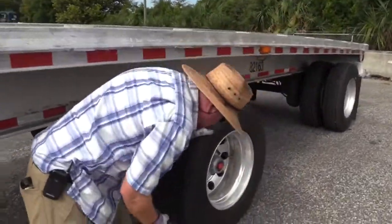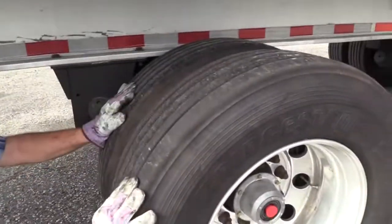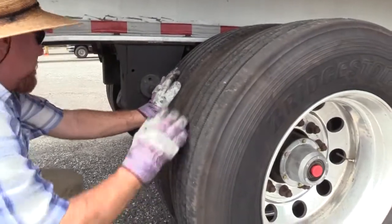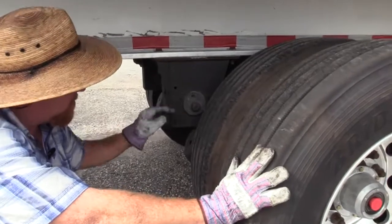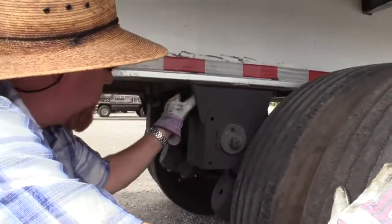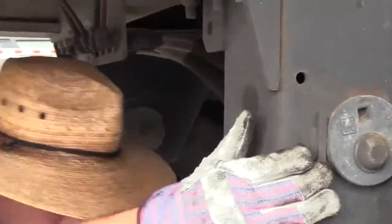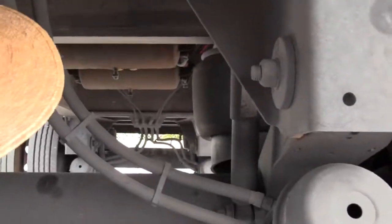Okay. We'll grab this axle right here, do our trailer axle. All right, again, I like to get the suspension out of the way because that takes me to my brakes, and my brakes take me to my tires, and that gets me out. Okay, so I want to check this trailer suspension arm bracket right here. Make sure it's bolted to the trailer frame properly and secured. Make sure it's not bent, twisted, or cracked. Get in here. This is kind of unique. A little uniqueness to this.